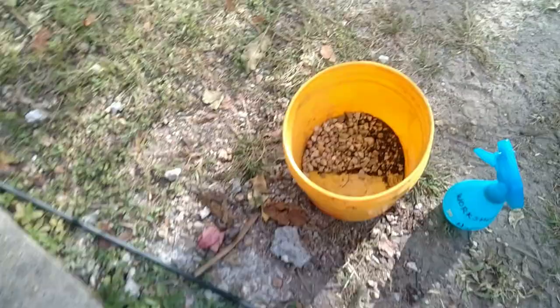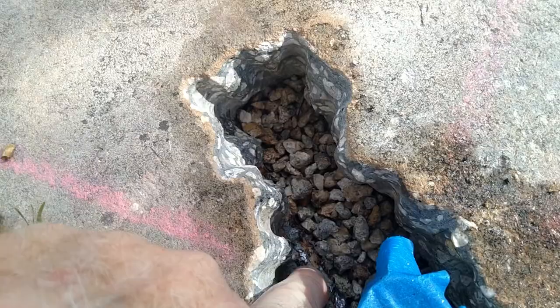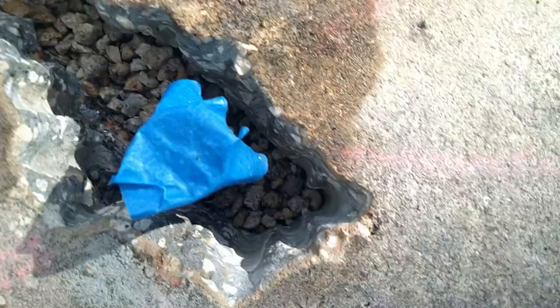I grabbed some gravel from my wife's gravel area and put it right in there along with some bigger rocks — I just didn't want any voids. It's got rebar as you can see right here. I left it nice and deep, two to three inches of patch cement. I put the cap on top when putting in the gravel to make sure none fell down in there, because it's a pain to get the vacuum attachment and clean it out. I also got a little rod and poked back in there to pack the void as much as I could. I recycled a bucket for the cement, but I suggest you cut off a piece of the box — rapid set cement all — with directions, which we'll be using.